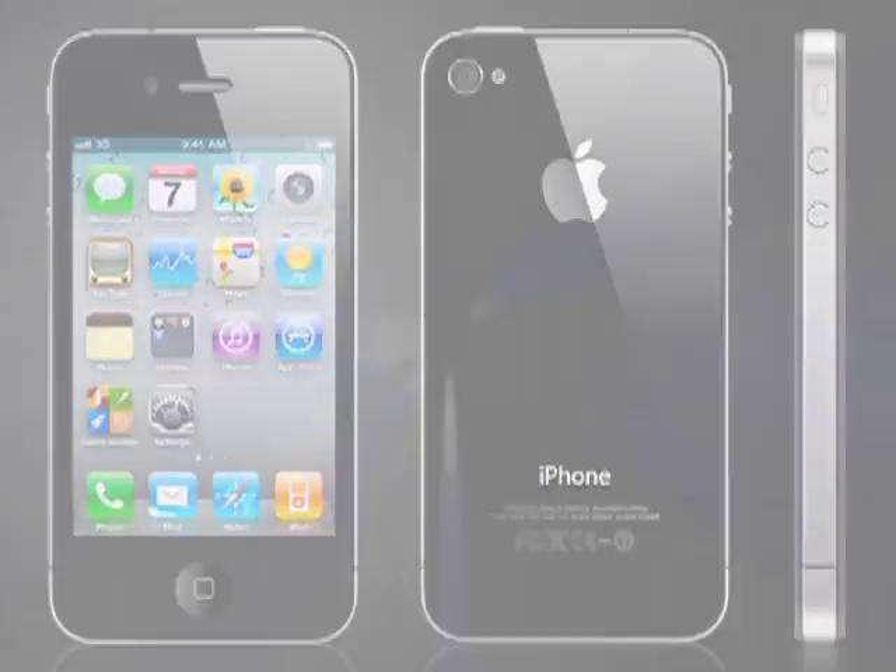Last year we had a micro-shutter for the camera. Our design in this class is to fabricate a micro-shutter designed to operate for mobile cameras — things like camera phones. Right now camera phones have very small image sensors but they don't have shutters. They don't need shutters now because the resolution is so low, but in the future camera phones will increase in resolution and will need a physical shutter to block the light. We felt this class is a great opportunity to use MEMS technology to fabricate a micro-shutter.